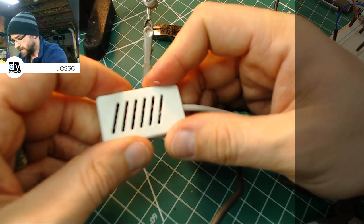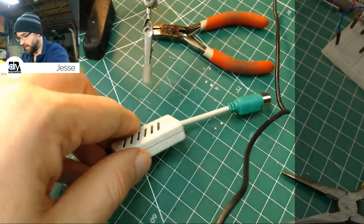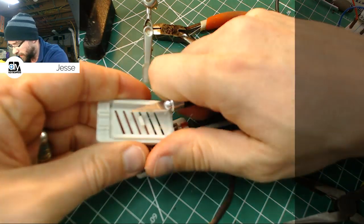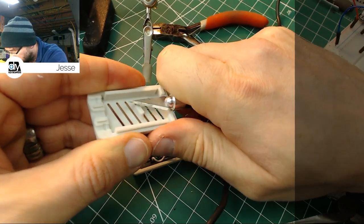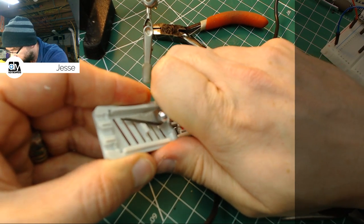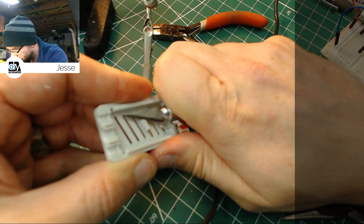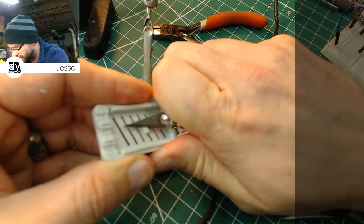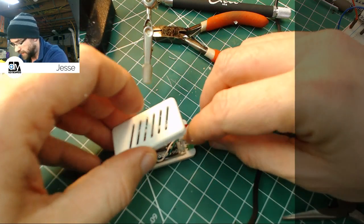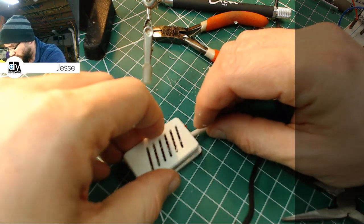Oh, you know what it is? That center post is too tall. It's pushing the whole center of the case up and out. So I'm just gonna knock off a layer or two off the print, about like that. That's all it is. And honestly, I'd rather have it be a little bit tall and trim it down than have it not be enough in the first place.